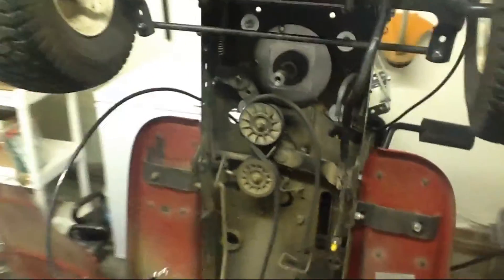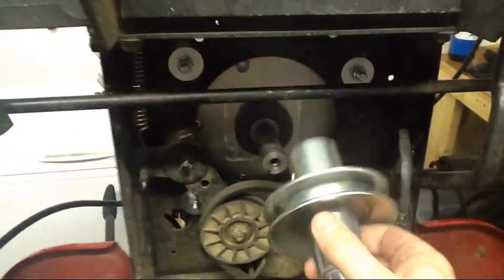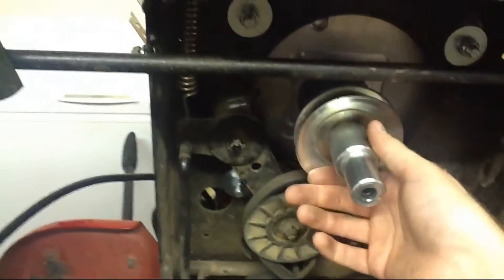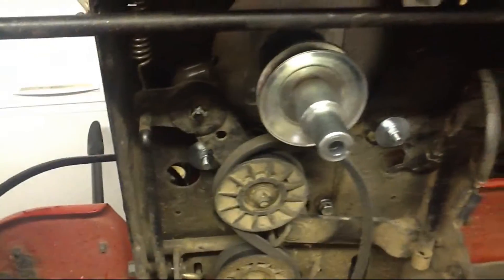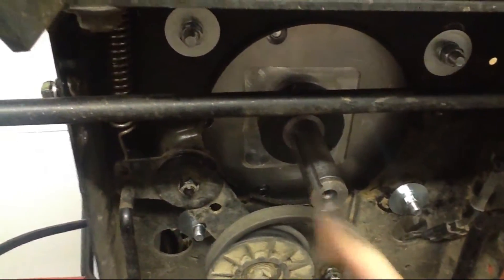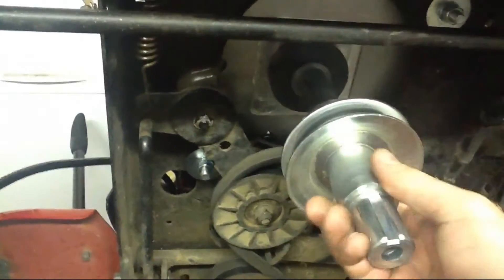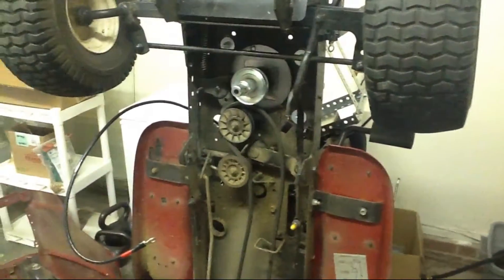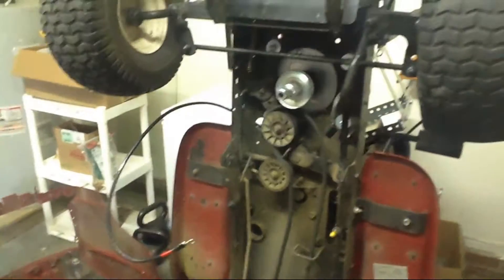When I start hooking this thing out, I take the spindle — or pulley — this guy came with the mower, off the gas engine. I had to mill a little key right in here in the spindle, and it'll go right in here just like the factory engine would. That guy slides on there. And then there's another pulley — that one works just the transmission, so that moves the mower forward and backward.